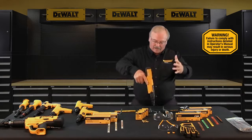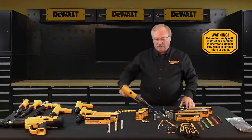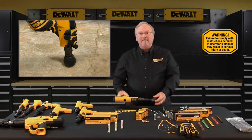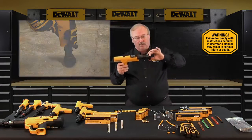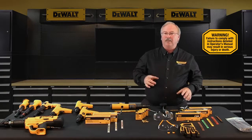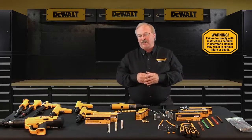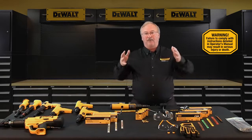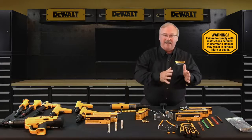When operating the tool, keep it perpendicular to the work surface at all times. You can use a spall guard whenever possible — a spall guard is a manually mounted piece of safety equipment that goes on the muzzle end of the tool. It will limit the possibility of fastener ricochet and help limit spall concrete fragments from causing possible injury to you or to bystanders. Always perform a test fastening with the weakest load level designed for use in that tool first.